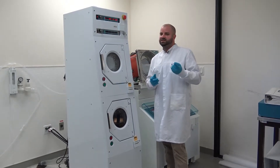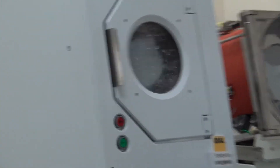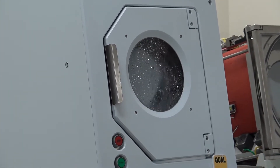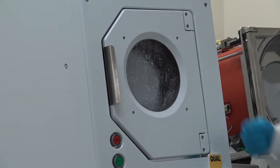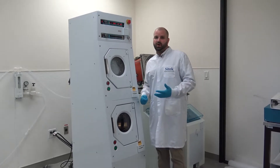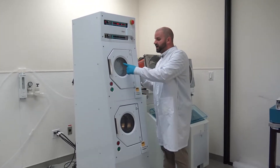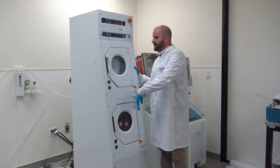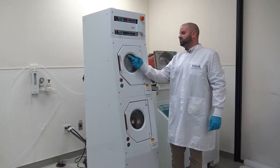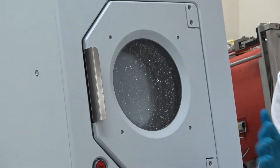So I'm going to walk you through our refurbishment process, our spare parts and service support for SRDs, and as well as other equipment we can provide at SciTech. So 15 seconds left to go on our rinse. When we move to our purge, we're going to speed up in RPMs and stay at high speed for our dry one as well. Once we speed up, instead of this water falling down on the window, it's going to start swirling. By the end of the recipe, there'll be less and less water droplets as we go. So here's the purge — we're going to start swirling.